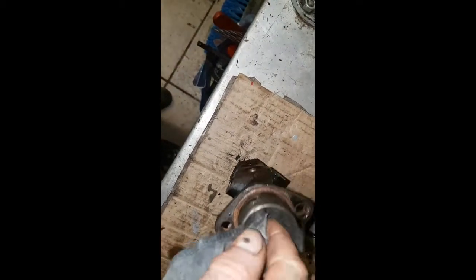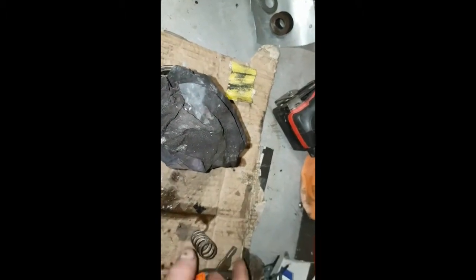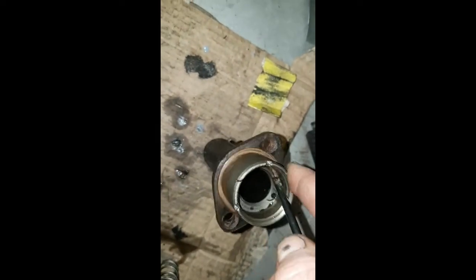You're going to need to clean that out — poke that in there with a screwdriver, sort of turn it around a few times, clean it all up. I'm going to repaint all this anyway. That come out — wipe that over. Give the spring a wipe. There is like gunge in there, it's like a rusty gunge. I'm using the screwdriver like that and just scraping — gently, not scratching it, just gently scraping. Get all that off, and also around the rim here where the new seal has got to go — you need to clean that off well.